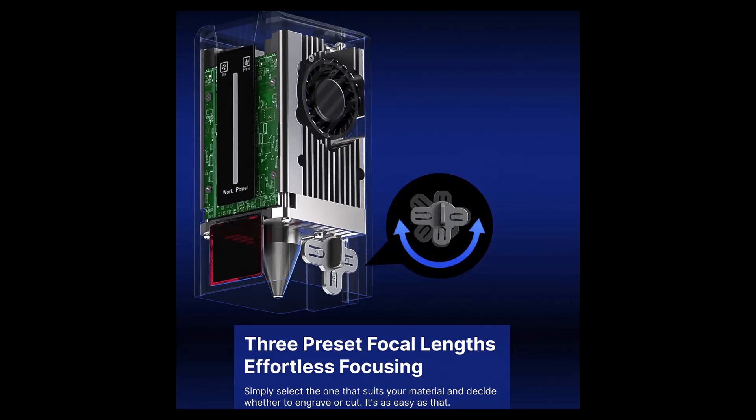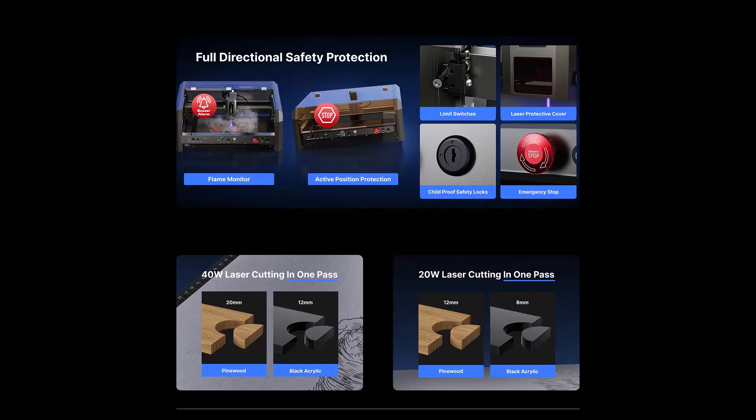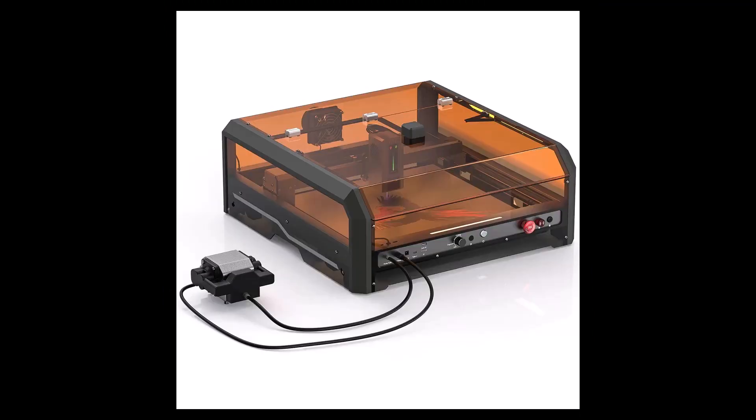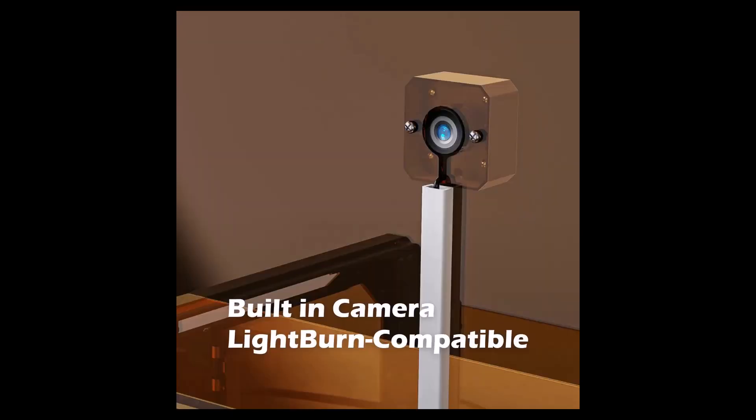The problem is you have to remember to set the focal point for the wood that you're doing your tests on. I haven't tried the plug-and-play engrave yet — we'll find out what that is. It has all the nice safety features. It's a beautiful machine. It is supposedly class one certified, though when you put the risers up I'm not sure if that still qualifies it as class one. It also has a built-in camera — it is a fisheye camera, so you have to remember it's going to be skewed on the outside edges of your screen, which takes a little getting used to.